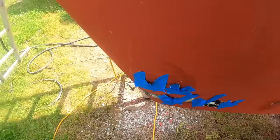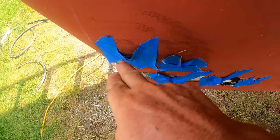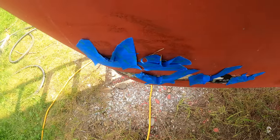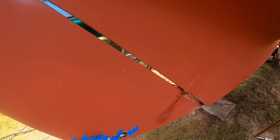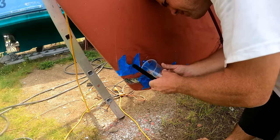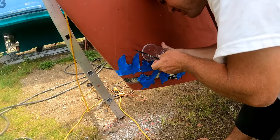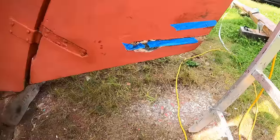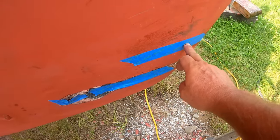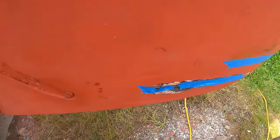I'll drill the new holes with a quarter-inch drill, which will leave an epoxy sleeve on the inside for the bolt to go through. I make little funnels to hopefully funnel the epoxy in and fill the holes up. Removing this rudder is a very difficult job, so doing it this way makes sense. The reason for filling the holes with epoxy is that the rudder is wood encased in fiberglass — you want to prevent any water from getting into that wood core, otherwise it might expand and crack the fiberglass. The epoxy is indeed filling and flowing right through, so that's what we want.